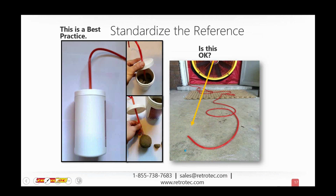Let's see. So, any questions here, Joe, that you want to talk about? No, I do want to have one. Yeah, go ahead. On the picture you showed, I picked on you last time when you showed this picture, but you show the tube elevated in the air and hanging from the hand railing. When that happens, that tube will oscillate back and forth and create quite a bit of pressure, even if there's not very much wind. You can figure that out yourself just by taking the tube and waving it back and forth while it's attached to the gauge, and you can see that. So it's always important that the tube is in a stable position so that the tube itself is not moving, because when it does, the flexing of the tube will create pressure. The picture that you show has the open end of the tube, which can be blown into, which is another kind of pressure altogether that is being picked up by the tube end, which is the velocity pressure.